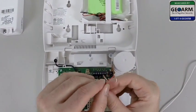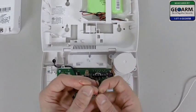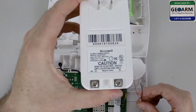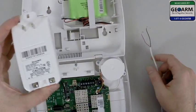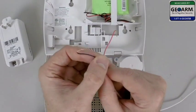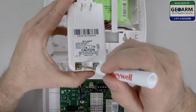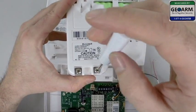The first thing I would like to note is that this system uses DC current, meaning there is polarity. You'll notice here on the transformer it says minus and plus. So let's go ahead and prepare these wires. We're going to unscrew these terminals just a little bit so you can expose some of the area.